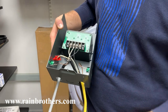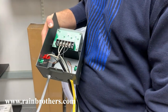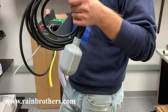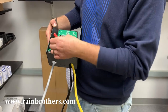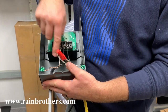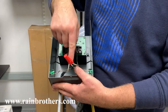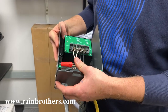If you're using a well reservoir system, we have a detailed video on that, but you may need a float switch in that case. Wiring in a float switch is very straightforward. Essentially you're just interrupting the hot leg of your pump supply with the float switch right into the Pump Saver.